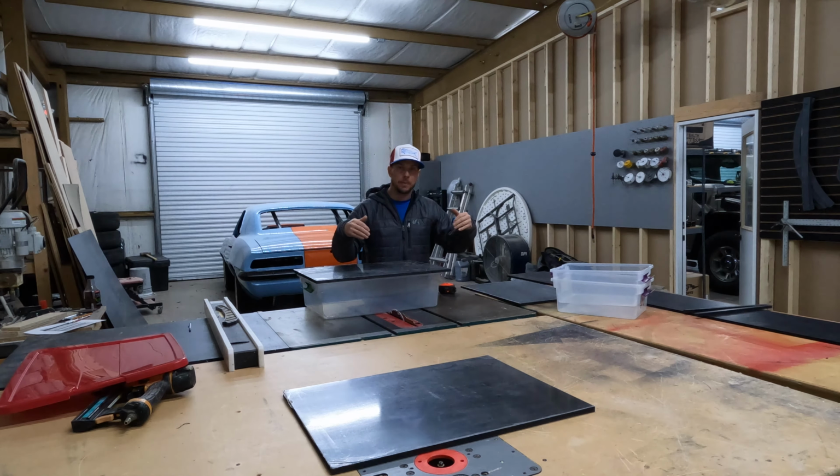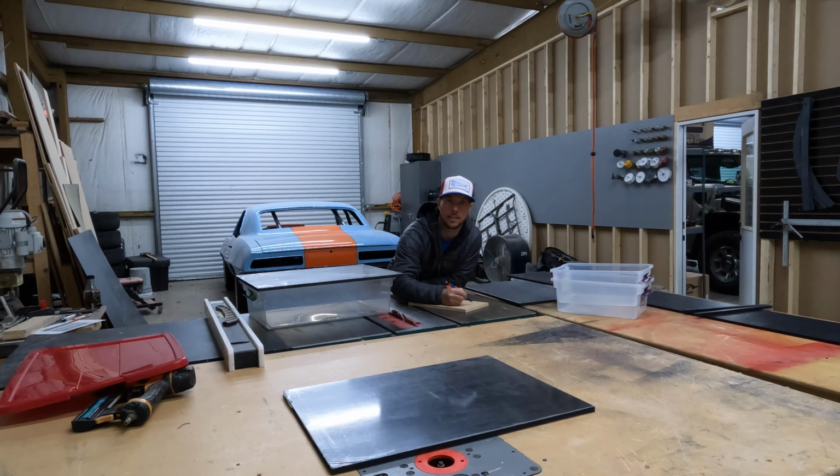So let's do our math right here. So I've already told you we're gonna have 7 slots. We're gonna make each one of these slots 6 3/8 of an inch times 7 slots, okay? And each of our shelves, we're gonna go ahead and say 1/2 inch, and that'll allow us about a 32nd to a 16th extra. So 1/2 inch times, we're gonna have 8 of these, okay? And then also at the very bottom, we're gonna set it up like a bookcase, and it'll have like a baseboard toe spot at the bottom where the sides go down past the bottom shelf so that your bottom shelf is not sitting on the ground. And I'd say we could make that 3 or 4 inches. You can make it whatever you want. Let's say 4 inches. So that'll be another 4 inches that we're gonna add on the bottom.